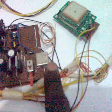Over here we have our sources of connection. So we have three sources of power to the board. We can either use the breadboard connection here, or we can use the 9 volts which we can supply here, or my favorite really is using the USB, this one. All that I would do is take my USB connector, which is this one, and connect it to my laptop, or anywhere you can tap USB from.